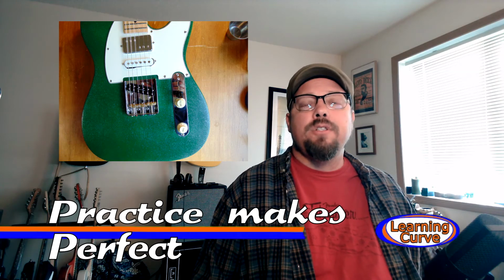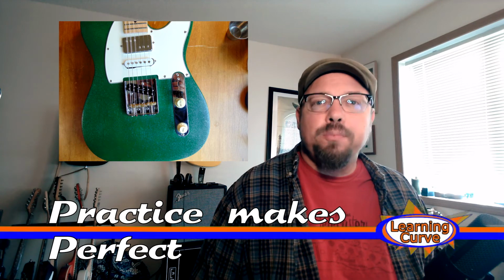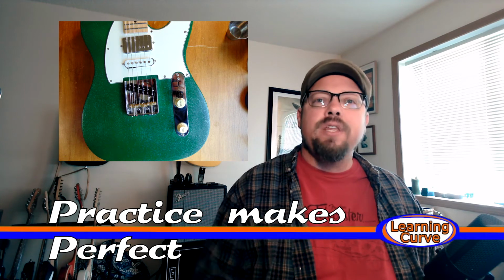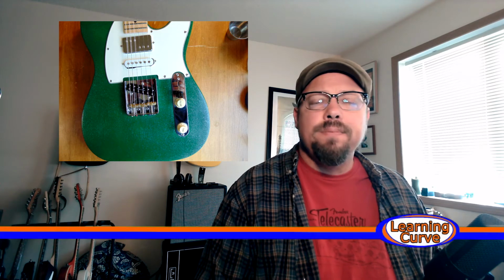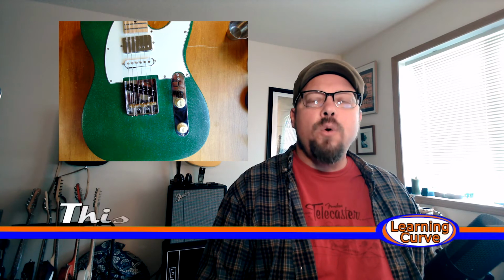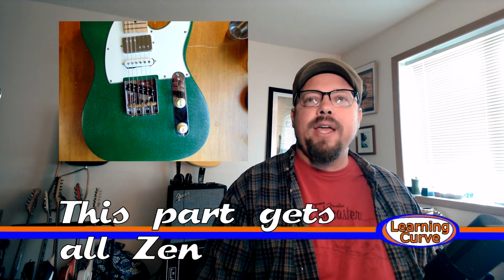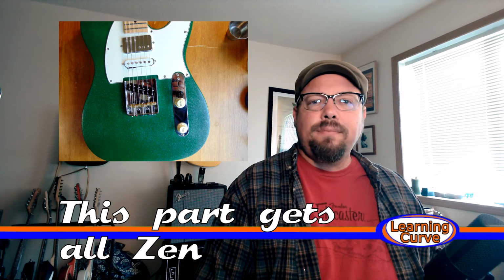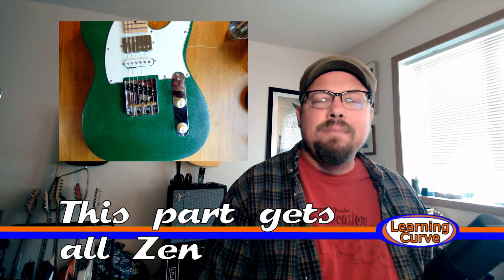Now, one of the reasons this looks better is I've just gotten better at applying spray paint. I'm better at keeping my distance and going smoothly and evenly. And I think that is the big trick to not getting drips. Temperature control also helps. But I really think it's just a matter of going slow and keeping the spray can, I think it's supposed to be like 18 inches away from the guitar body, and being patient and being mindful. Like everything in life, be patient, be mindful, you'll do better work.